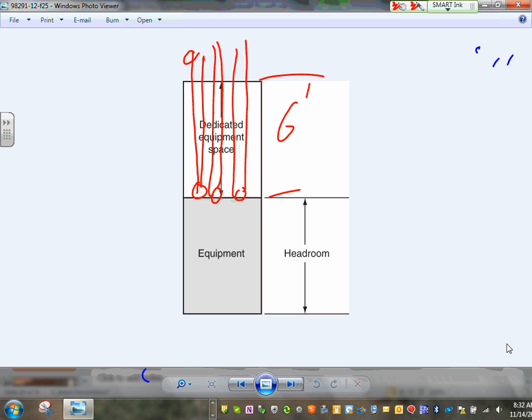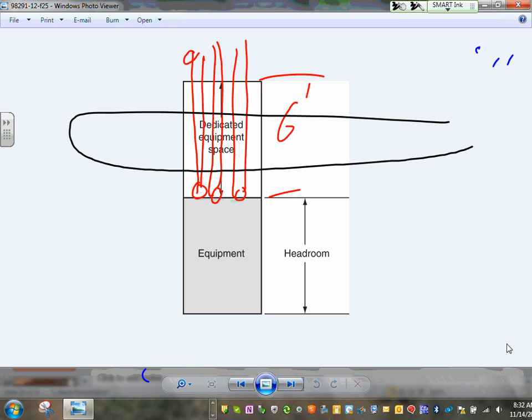So, can I bring right in this space my duct here? Big duct coming in here, heating and cooling duct, can I bring it right here? No. Can I bring a suspended ceiling like this, guys? Suspended ceiling is an exception. Can you see that one here? The suspended ceiling, 6 feet from here to the top, the suspended ceiling is okay. Suspended ceiling or false ceiling is okay to enter.